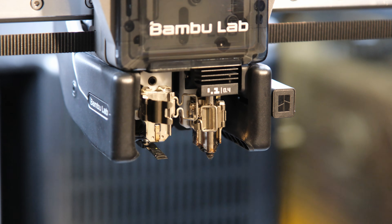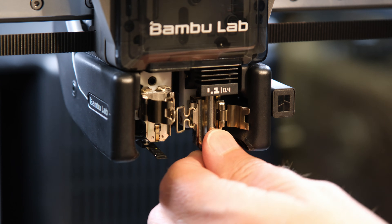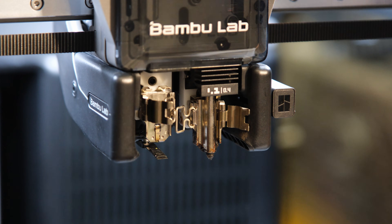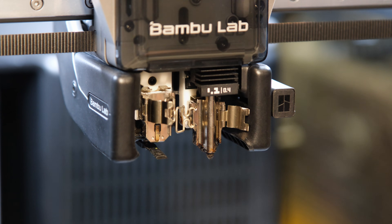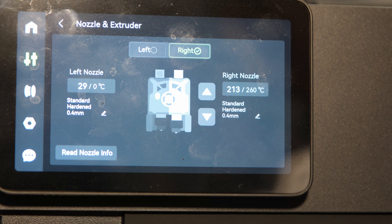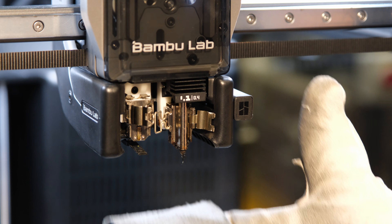Select the right side hotend from the menu. Sometimes the hotend is stuck to the frame. The reason is melted filament that has gotten between the frame and the hotend. By raising the hotend temperature to 260 degrees and waiting 6 minutes, the PLA will melt and the hotend will come loose.